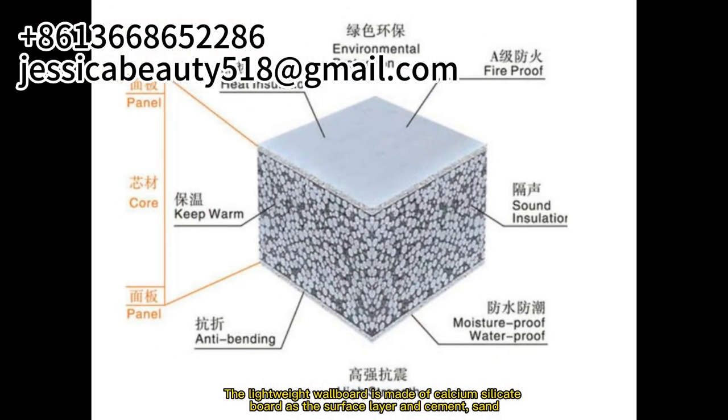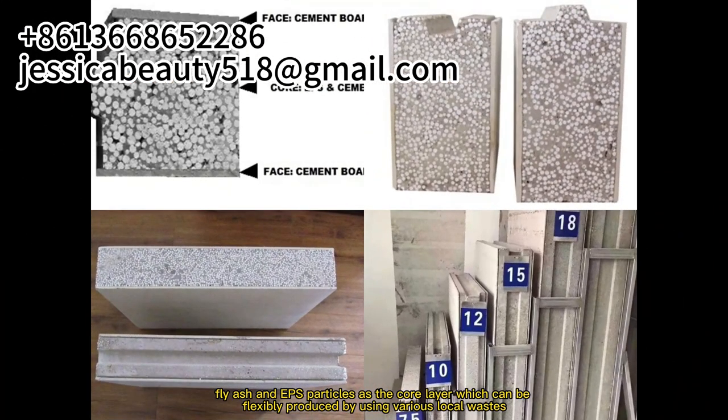The lightweight wallboard is made of calcium silicate board as the surface layer and cement, sand, fly ash and EPS particles as the core layer, which can be flexibly produced by using various local wastes.